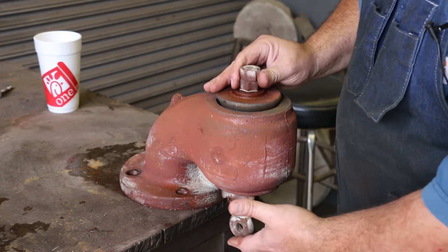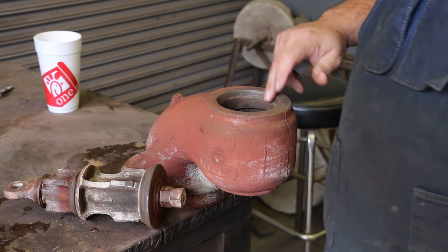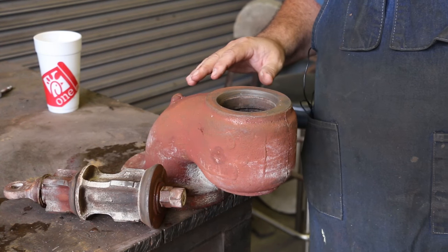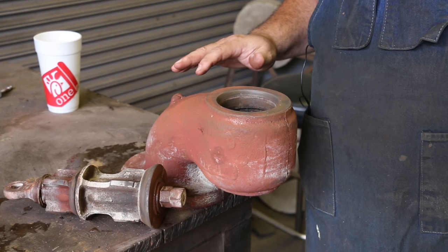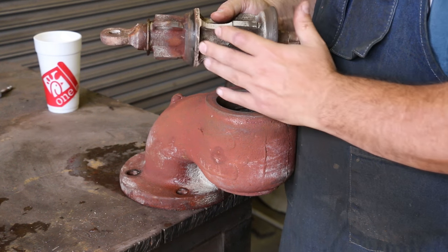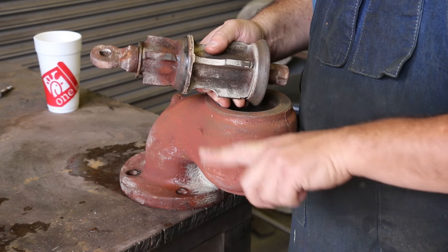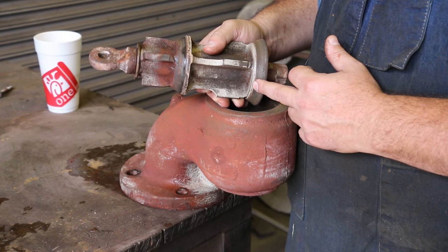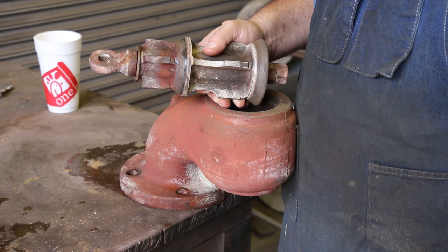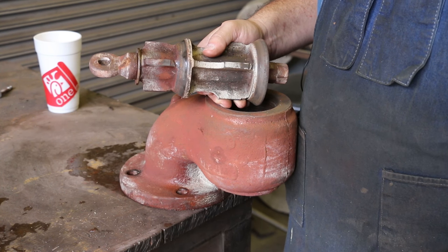So this is what we're working on. The problem is the valve seats in here — these valve seats have, over many years... remember this locomotive is nearly 100 years old, and I don't know that this valve has ever had any work done to it. These valve seats are just not very good anymore. In fact, I can lay a straight edge across this and you can see it's just kind of dished out. What that means is that even when the valve is closed, there's still a small amount of steam that's leaking through. It's not enough to move the locomotive, but it is enough to have steam coming out of them — it's just aggravating. We want to get this thing so that when you shut that valve down, it shuts down.